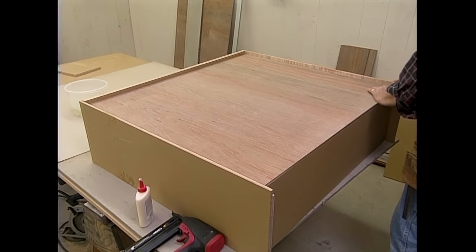For the last few minutes I've been working on the parts for our storage drawers. I'm using half-inch thick MDO plywood — I have side pieces, front pieces, and back pieces. I'm running a quarter-inch groove in all of those pieces to receive the plywood bottom. Here I'm expanding the dado to half inch — you'll see why in a minute. Whenever I change a blade, unplug the power tool. Here I've installed a stop block which is going to be a guide so that as I push the piece through it won't bind up. This half-inch dado is going to be for the back of the drawer.